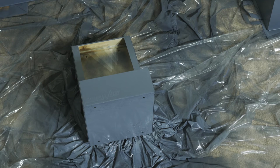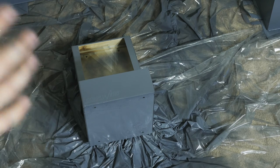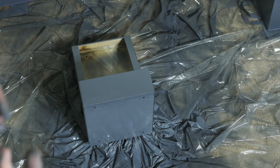And then after the white, I might do some clear coating just to give them an extra layer of protection. But so far, from what I've gathered, the primer has dried really nice and smooth. So sanding these down to the bare metal has really paid off already. So I'm hoping that'll carry over with the white, doing real thin coats, maybe like two coats. And hopefully I won't have to do much sanding other than the bottom on this one. So anyways, let's let these sit overnight, and when we come back, we can do some painting.